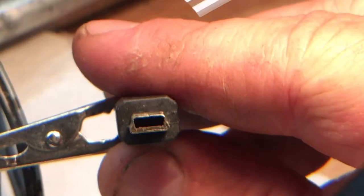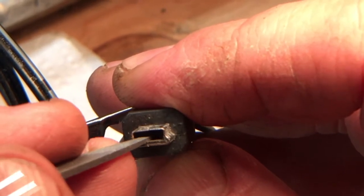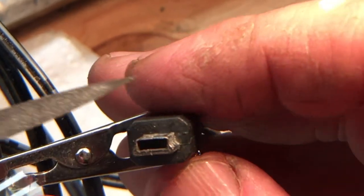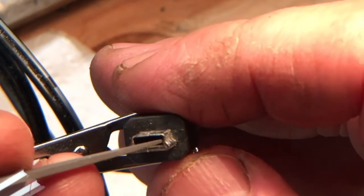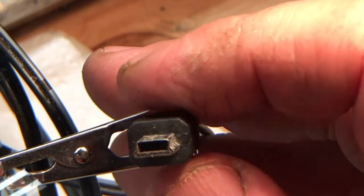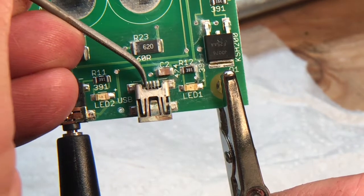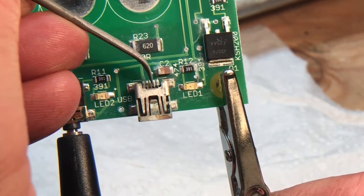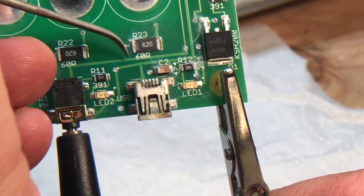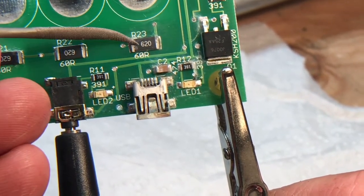You can probably see that the room sensor thermocouple is pretty corroded in there. This is a very fine file — like an emery cloth except much stiffer, an actual fine metal file. I use this to clean contacts and things like that. Looking through a magnifier, there was some corrosion in between these soldered connections here, and you can see a little bit of white still on this capacitor and a little corrosion here. There was water accumulating in here.